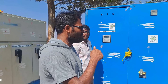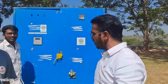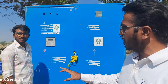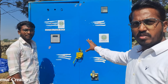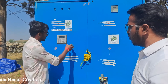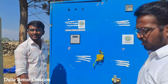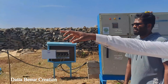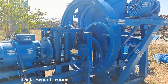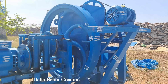We have a few more questions. The machine just doesn't get switched off with any button — only the off button on the distribution box will actually turn it off. Else, because of gravity, the wheels will keep running and power will keep growing. So now you are going to stop. After you hear that particular noise, you will see that the wheels stop vibrating in the housing. The tachometer will show that the RPMs keep reducing, and the machine will halt. Right now there is no power generation.